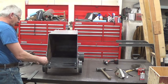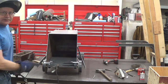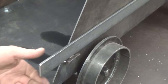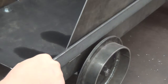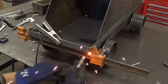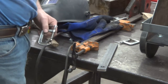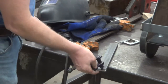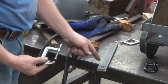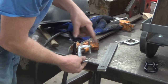In the front here I'm going to want a stop. I put some little pieces of angle iron — we're going to clamp those. This is going to work real good; we'll go ahead and weld them into place. That's going to stop that. I'll cut a couple more pieces of the strap, about 14 inches long. I bored a hole through there that a shackle will fit into. I'm going to tack weld this here on this end so it stays situated, and then where I do this line I'm going to bend those out to make a kind of an A-frame that'll fit on that.